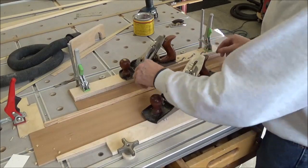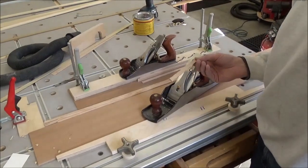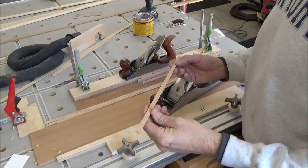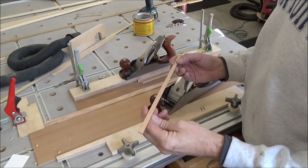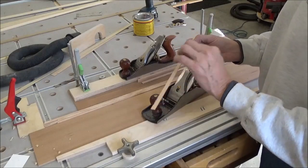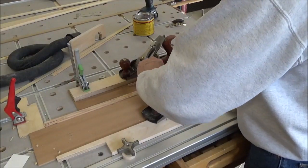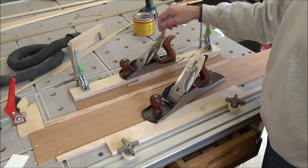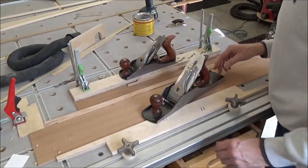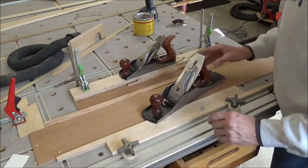What I've done here is I've taken and planed some oak, some red oak to match the facing of my bolt bin over there. They're all the same thickness and now I have to get this edge. One edge was already jointed, now I need to get the other edge jointed using my hand planes. I use this jack plane to rough it down and then use this number 5.5 to finish it up.